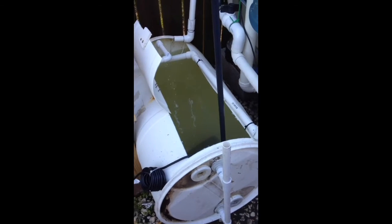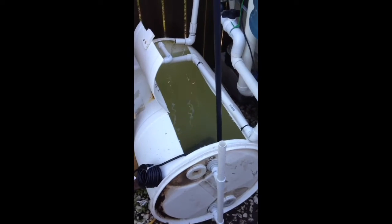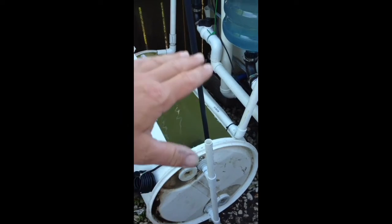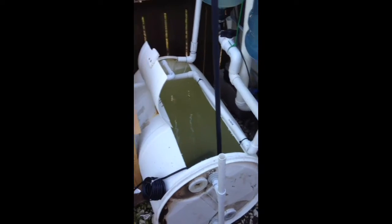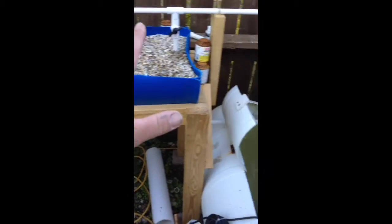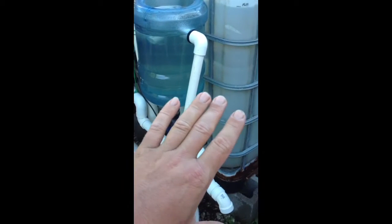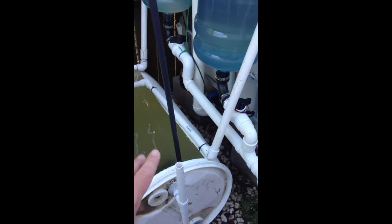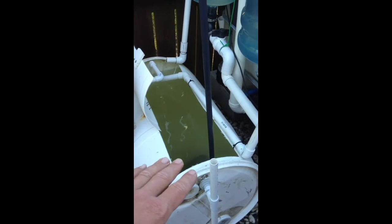Here's the 55-gallon drum I mentioned before. I said I was going to cut it out if I needed to because I was having too much water fluctuation — which I was. The 55-gallon drum gives me more rise and fall to play with, even if my adjustments on the pump and everything else aren't quite right. This creates a safety net because it can hold more volume.